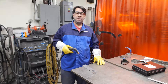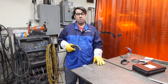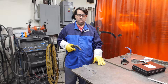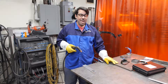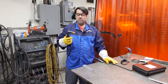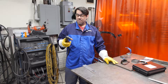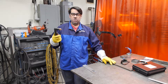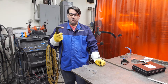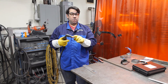Like with welding, the best way to improve your proficiency when plasma cutting is through practice. Come in and grab some material out of the scrap trash can in the welding shop or the drop bins in the sheet metal station. Lay out some line work, make sure it's clear of the table, and do some cutting. Use our templates and after a short period you'll be able to produce quite high quality cuts using the plasma cutter manually. However, there is one important caution related to equipment safety: don't ever dry fire the torch. That means don't hold the torch and pull the trigger just to see the starter arc unless you're cutting a piece of material, because doing so dramatically shortens the life of the consumables in the tip of the torch.